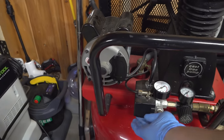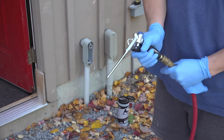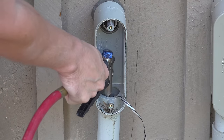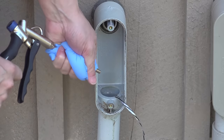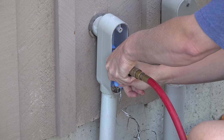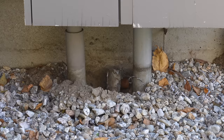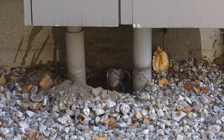We've got our new string. Any time you find an old pipe in the ground or an electrical conduit, it's very often filled with water. I can't explain how the water gets in there — sometimes bad joints underground, or maybe a little rain gets in the ends. I knew for sure there was going to be water because when I pulled the old string out, it was wet. So all I did was turn down my air compressor, shoved it in one end, used some gloves to kind of seal the pipe, and gave it a blast. As you can see, there was a lot of water in this pipe.